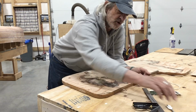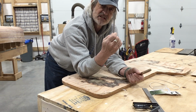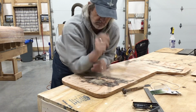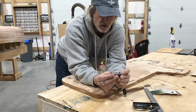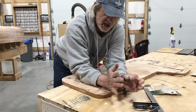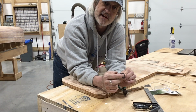So what I think I'm going to do is put a dowel back in here that'll fill up this hole, take my 13/16 spade bit, over drill this, mix up epoxy, cut these dudes down. Slippery little buggers. Cut these dudes down to where they're an inch. Cut these off so that they're 1 inch together, which is the width of the board, and then glue those in there with the thickened epoxy, taking great care not to get it in the hole.